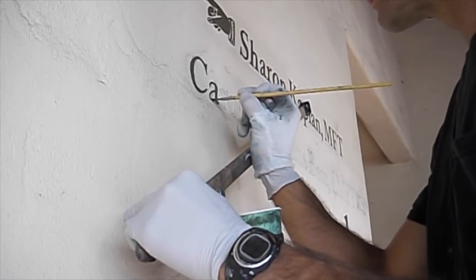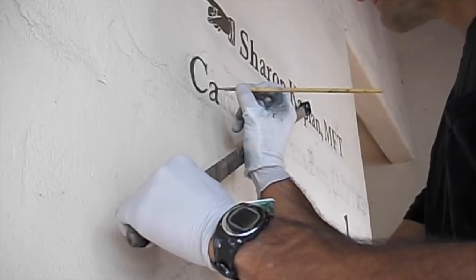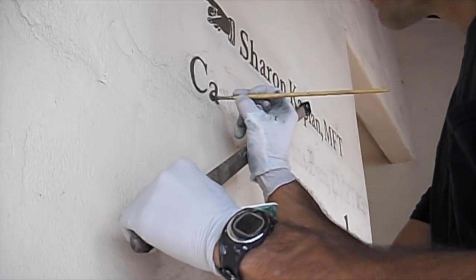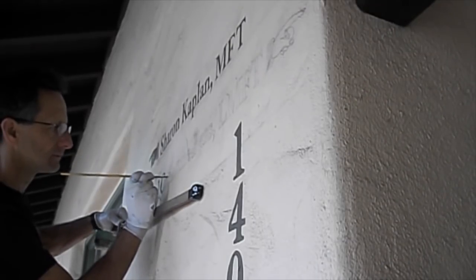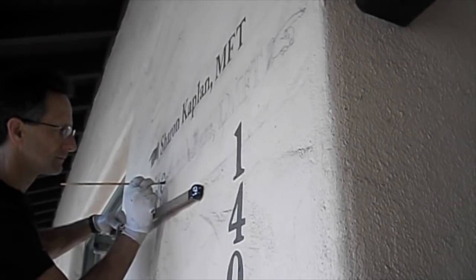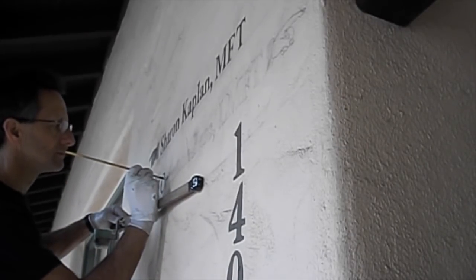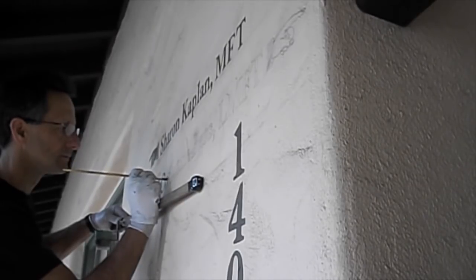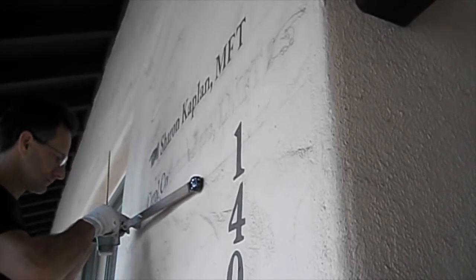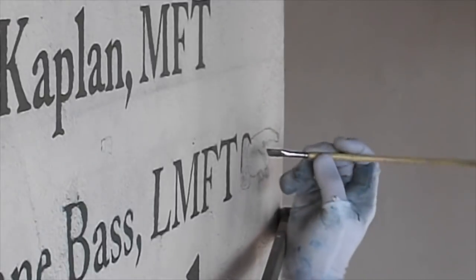I only use an angled Fitch when I'm doing lettering like this, simply for multiple reasons — one is control, one is being able to get really tight corners. I'm rolling along and starting to get a rhythm. The mahl stick really stabilizes me, helps me get my hand up off the surface of the wall and also keeps my brush perpendicular. I got my nose directly centered with the letter so I can get really good straight clean lines, although I do have a very clean outline to follow.